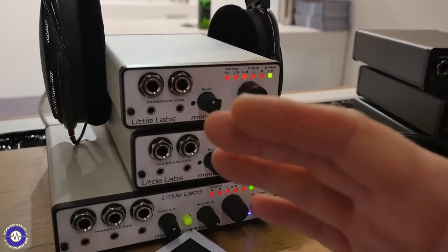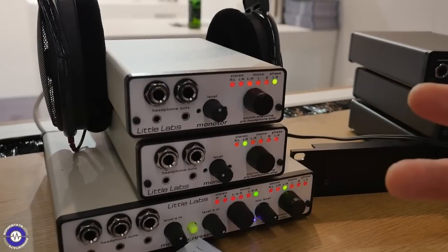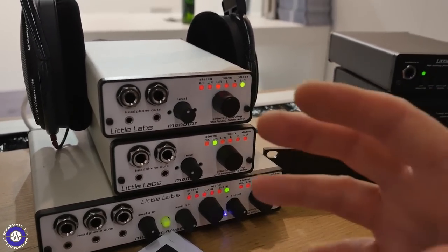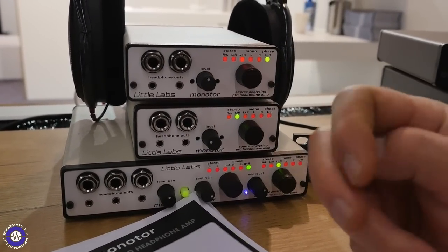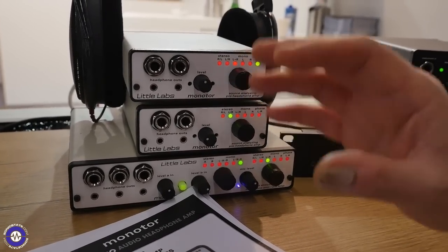But also for the audiophiles out there who want to use this, if they're using, for instance, an Oppo 105 player that has a very high quality balanced DAC in it, and it comes out balanced without a balanced chip. It actually comes out of the DAC balanced. Those have a very high quality volume control built into the DAC. So you don't want to go through two volume controls being redundant. And this way, if you bypass this, what's better than a volume control? No volume control. You can't get more high-end than that. So that way you're running the volume control through the DAC itself.